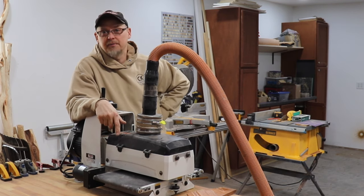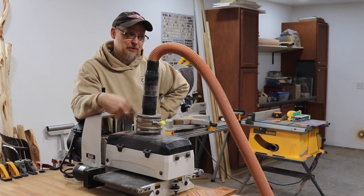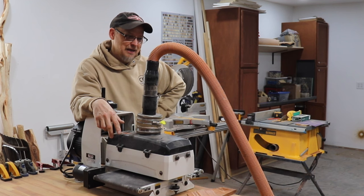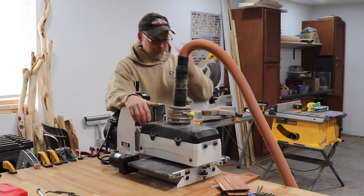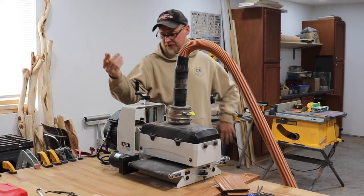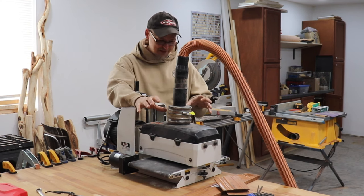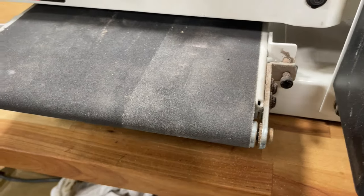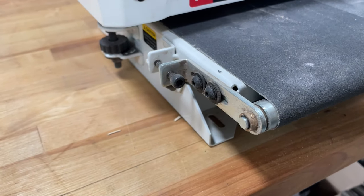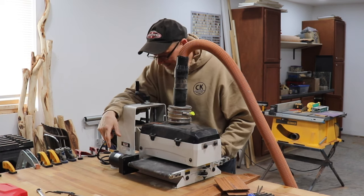I've been playing around with it before I pulled the camera out — this wasn't even my intended video today. I've been at it for a better part of an hour, playing with the belt tension, loosening it completely, trying to tighten it with the set screws. As soon as you tighten it even just a little bit, even without any material loaded, you turn it on and it'll spin, stop, spin, stop.